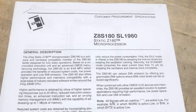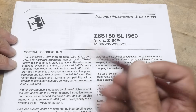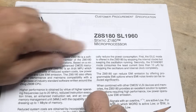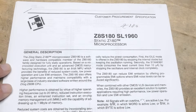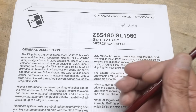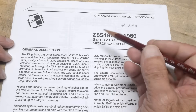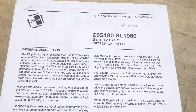What about today? Is a Z80 dead? No — they're fancier now. This is a Zilog static Z180. Instead of a Z80, this is a Z180. It can run Z80 code just like the old days, except it has a bunch of other things thrown in as well. And it's much, much faster. Remember, 4 megahertz was what you needed — well, this is a 20 megahertz part. And there are other ones good up to 33 megahertz or beyond. So yeah, it is a fast part.